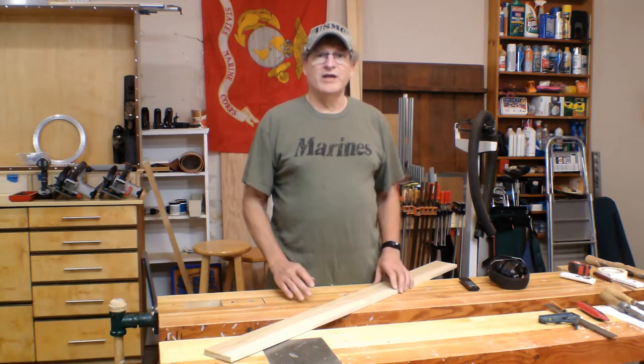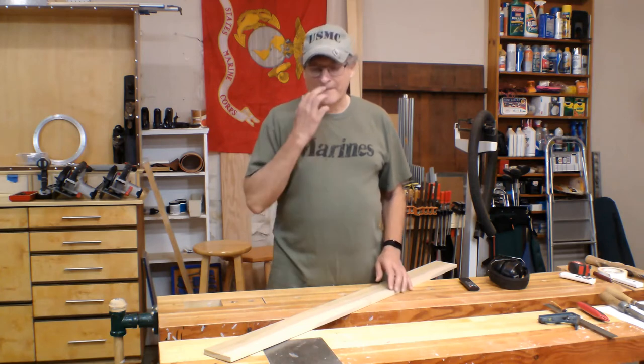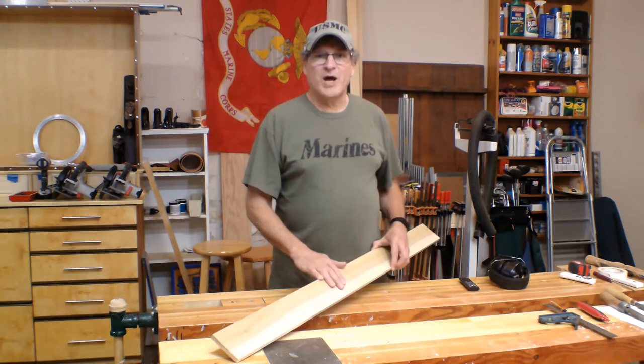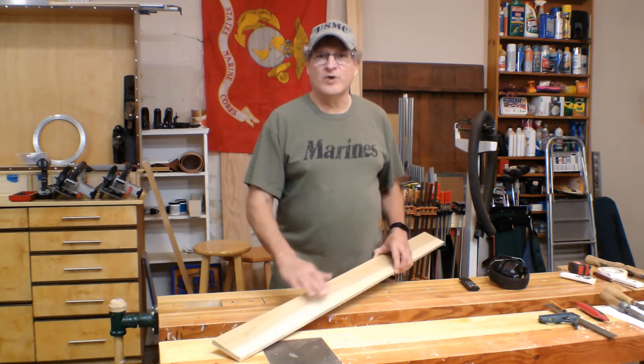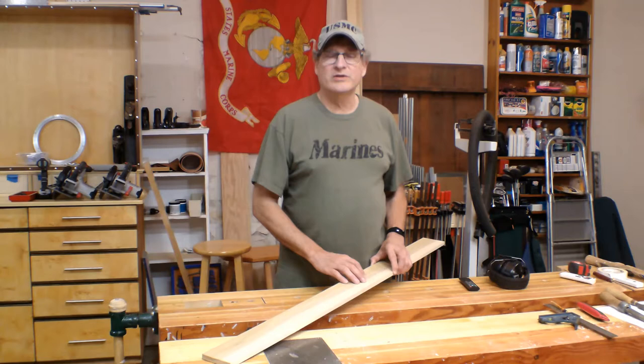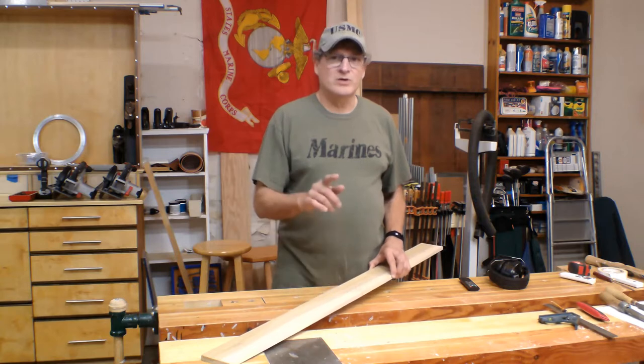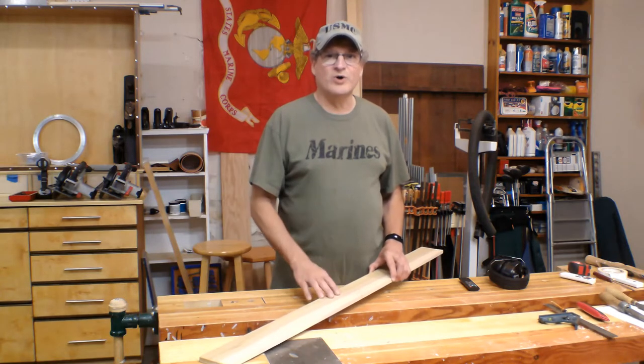Thanks for joining. Today, we're going to show you how to make really cool epoxy river coasters. We're going to take this poplar board, half inch thick, with about a 3/16 inch river trench in it, and we're going to pour in some epoxy mixed with some blue and white mica powder. So keep watching, we'll show you how to do all that.